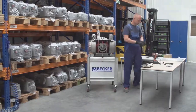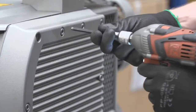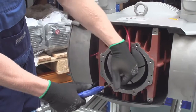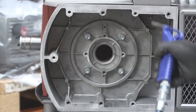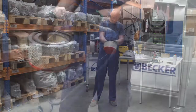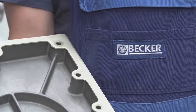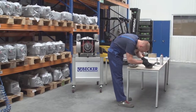To remove any vane dust, remove the covers and blow out the suction chamber, exhaust port, and intake port. Then blow out the cylinder while rotating the rotor. Using compressed air, blow out the inlet filter from the inside out. To avoid damaging or denting the filter element, never tap it on a hard surface. Also check the condition of the gaskets under the suction cover and exhaust chamber. If the filter is too dirty, replacement is recommended.